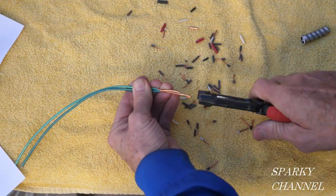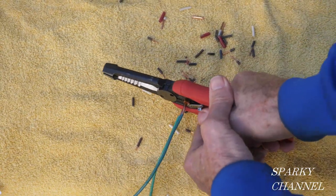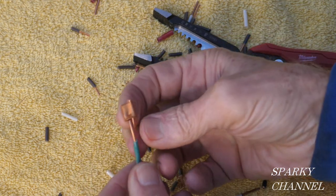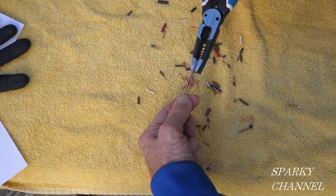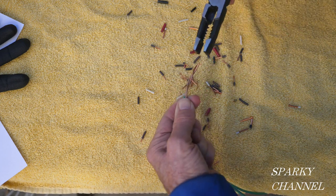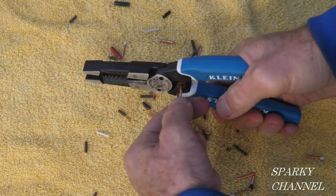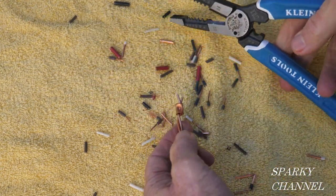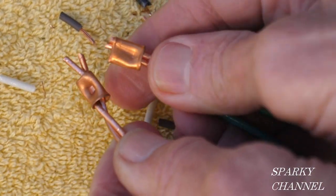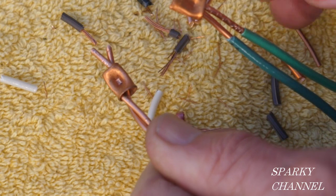Let's crimp some ground wires. With the Milwaukee, give them a twist, put the crimper on there, give it a nice crimp, and cut off the excess — that's what the crimp looks like with the Milwaukee. Now the Klein's — you have a larger area with which to twist, and I think it's a lot easier to twist wires with the Klein's. Then put the crimper on and give it a good crimp. This is a better crimper — look at the difference. You can see the dimple it puts in. There's a very noticeable difference in the crimps. The Klein does a better job for regular household type wiring crimps.